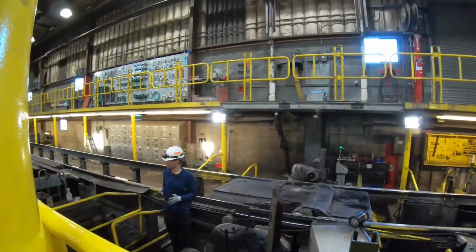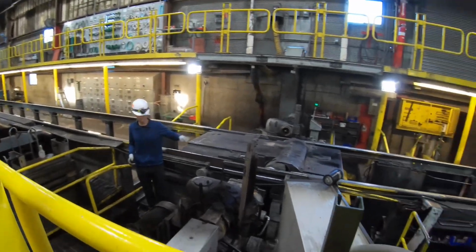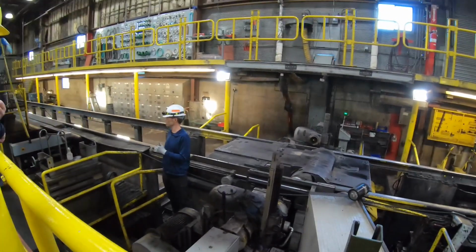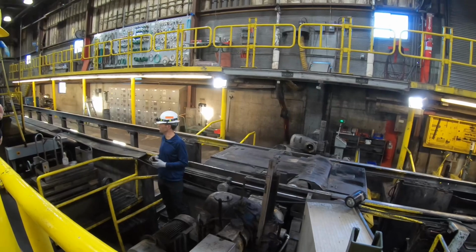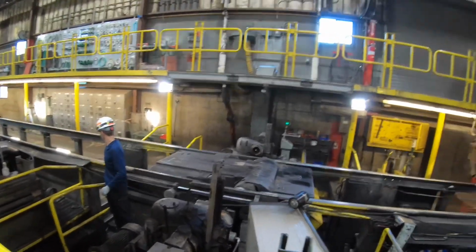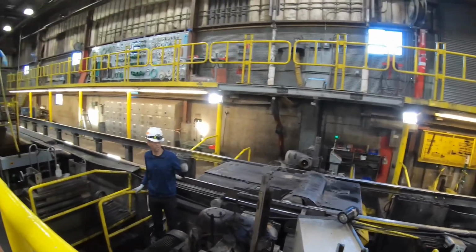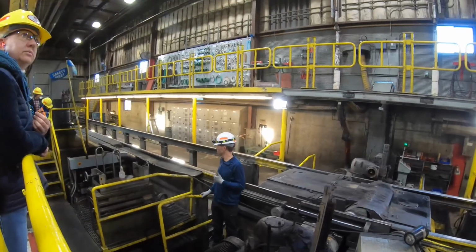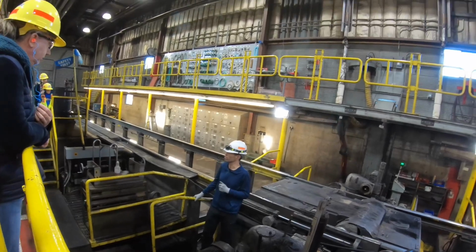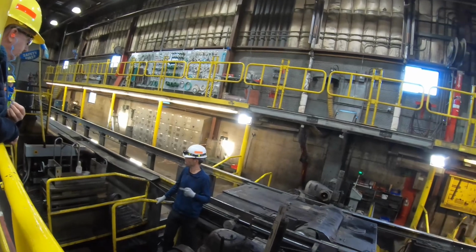So any engine that's coming in for traction motor problems, which are the motors on the wheels, or federal inspection, which we do every 92 days, annually. Those are kind of the maintenance cycles we do on our locomotives. We'll bring them in here, electricians and machinists can check the bottoms, change the fluids on the motors, change filters, and then also what we do in this facility is reprofile the steel wheels on the locomotive, which means we cut the locomotive wheels with basically like a big lathe.